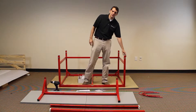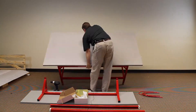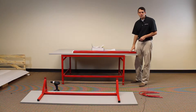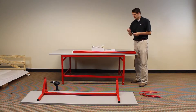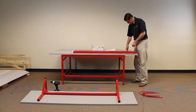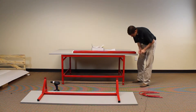So now we've done everything we need to attach the four legs. We're going to flip the bench over and attach the upper support. Now I'm going to attach the two rear unistruts using the two and a quarter inch hex cap bolt, an associated washer, and a cone nut. We use two bolts on the lower side on either side of the leg, so I'm just going to slip those through.